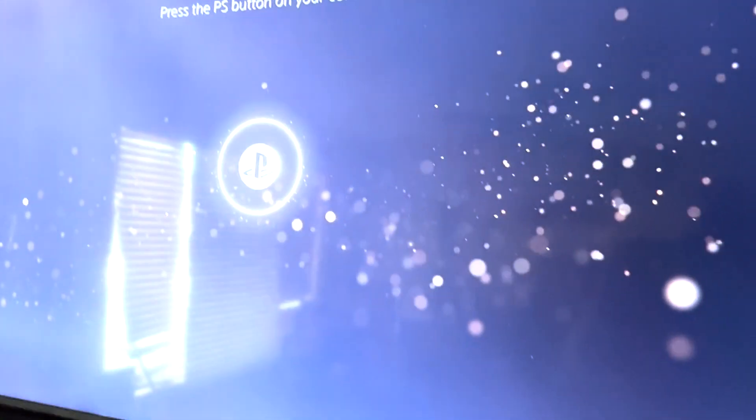Let's turn it on — and there we've got the logo, and there we go. Everything's working: sound, display, everything looks really good. We've been able to get the PS5 Slim up and running again with image. Somebody really struggled to replace the HDMI and failed, but luckily it wasn't much more than a new HDMI and a couple of small components. It could have been much worse — they could have pulled every single pad and I'd have had to run a bunch of jumpers. If you found this video useful, smash the like button, subscribe for more videos like this, and let me know if there's something you'd like to see. Thanks for watching — see you in the next video.